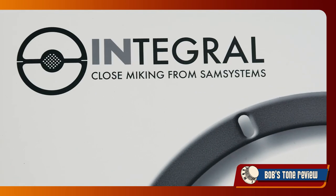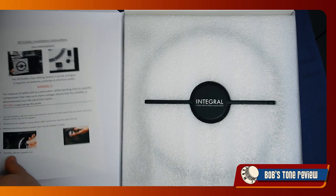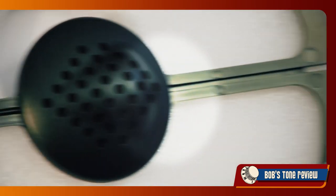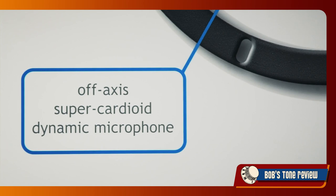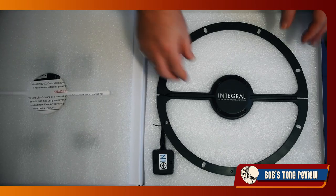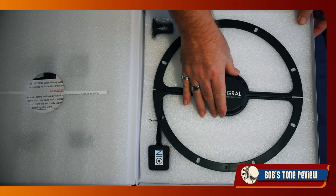The Integral's microphone is already set on an average speaker's sweet spot, so all we have to do is simply plug the XLR cable from our amplifier to the mixing desk. The Integral system relies on a quality dynamic microphone with super cardioid pickup pattern, located directly in front of the speaker cone. The microphone capsule is positioned slightly off center and off axis on the spokes of a round, thin and light plastic frame. It's an easy plug-and-play solution, operated without need of phantom power or batteries. The frame has a perforation matching standard speaker's mounting holes, allowing a quick installation between the speaker and the baffle.